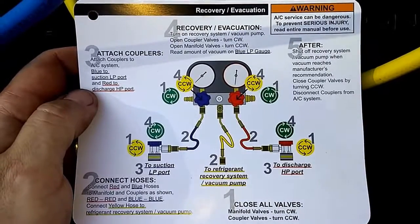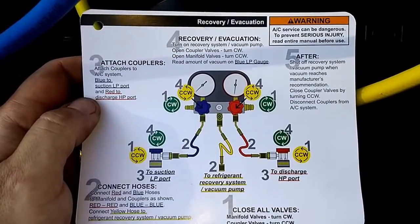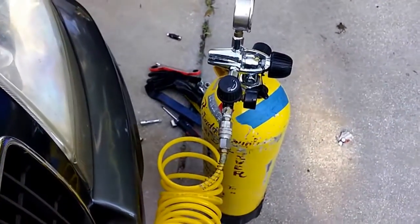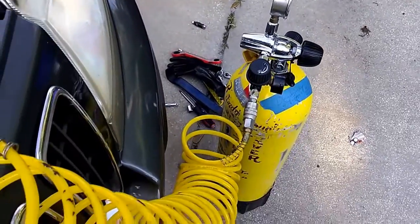Okay, this is what I'm doing — the evacuation recovery. So I'm doing the evacuation. This is the instructions and I've gone ahead and followed these. There's the vac pump. I have a little scuba tank set up as a compressor — my little custom deal there. I'll probably use a compressor later because I don't want to waste all my air.